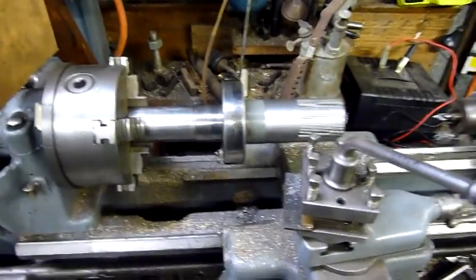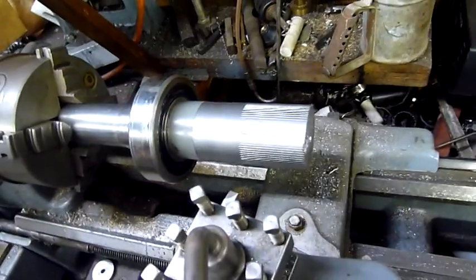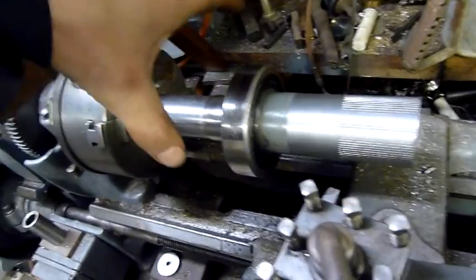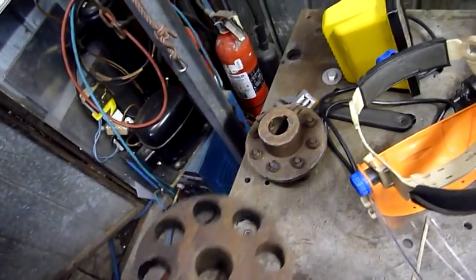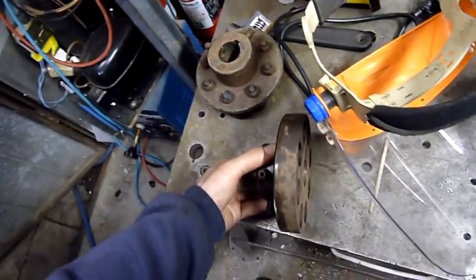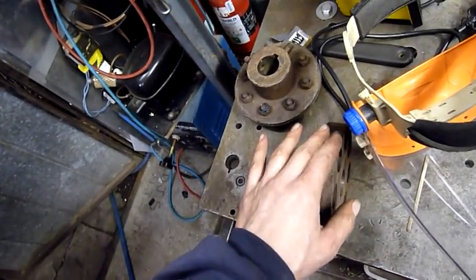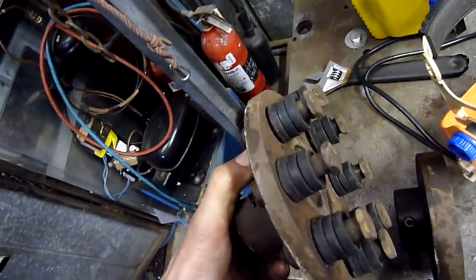As you can see, we've progressed a little bit more. I've cut the shaft in half after turning most of it down between centres. I'm basically going to turn off the remaining splined bit and just use that as my drive coupling — that'll be the output. There'll be an end bell and bearing retainer, then a retention plate, and then the coupling, so it'll be fairly stout. There'll be a little bit of play — you'll be able to see the shaft turning, but that's about it. I have to drive this from the crankshaft end of the engine, so I can't use the existing PTO flex coupling shaft.